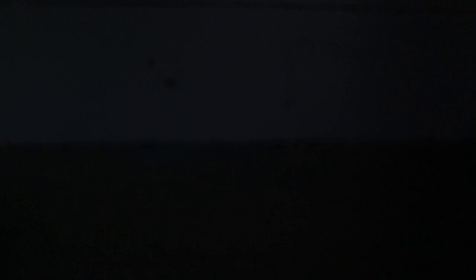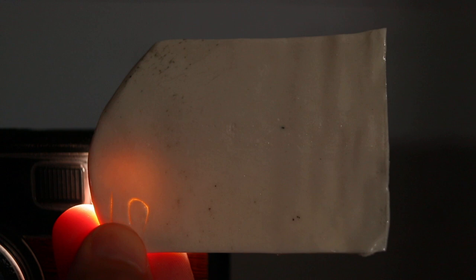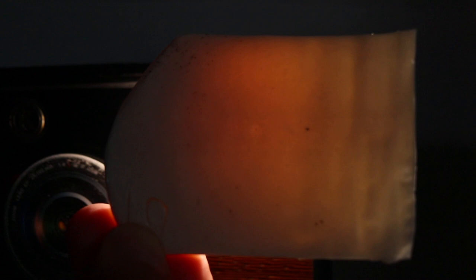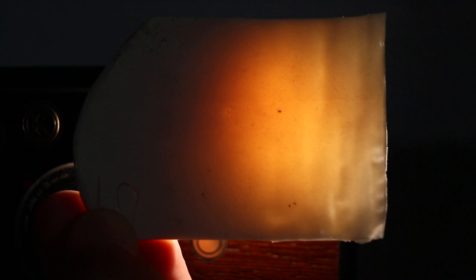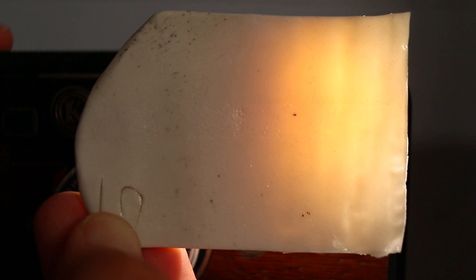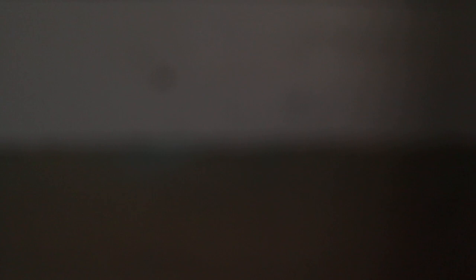Number five: 20% EPK, 25% China clay, 25% Nepheline syenite, 5% Gerstley Borate, 25% Silica. Higher Silica to increase firing temperature, a little Gerstley Borate, a little Nepheline syenite, and to save money and increase plasticity, I included EPK. Translucency is okay — a little on one side, a lot on the other. Decent through the clay and glazes. I don't think it's any less translucent than the others with similar flux levels. The black spots you see might be from the EPK — EPK has more iron. China clay has less iron; it's one of the second whitest kaolins. That could be why there are speckles.